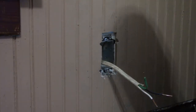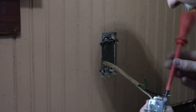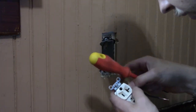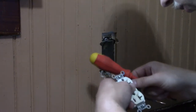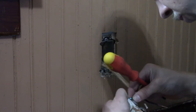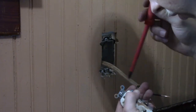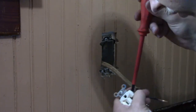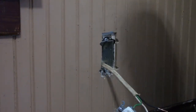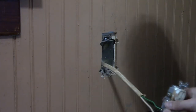Two things to point out: first, I need to know which way the screw tightens — I want the wire to lead from that side. Basically, when you use one of these little screw terminals, you want to wrap the wire around it going the same direction that the screw tightens, so as it tightens it pulls more wire into the screw rather than trying to push the wire out, because that'll make it very difficult to keep it secure.